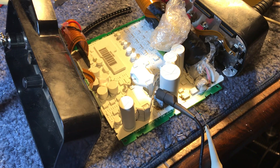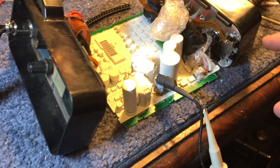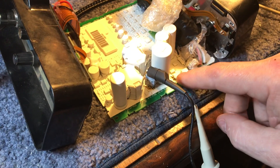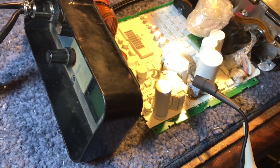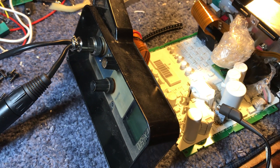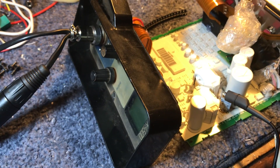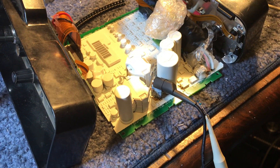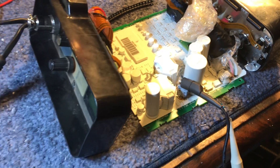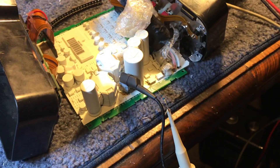I've been trying to work out why these things keep failing. It's part of the clamp system that clamps the flyback voltage from the coil after it goes through these two diodes here, and there's a feedback circuit that keeps it at about 175 to 185 volts. Over the years I've seen it clamped at different voltages — 175, 185 — but the FET there is only rated at 200 volts.